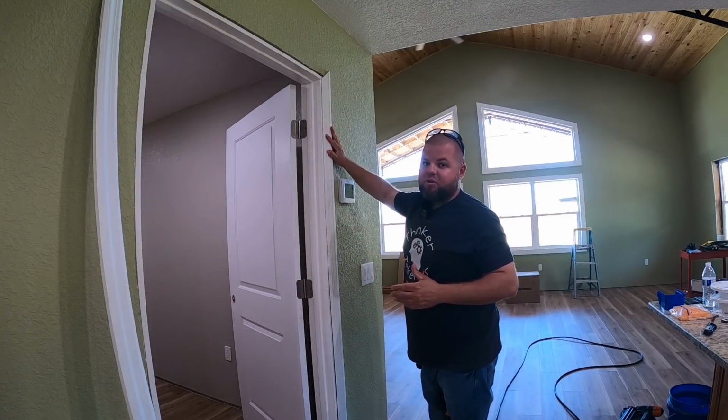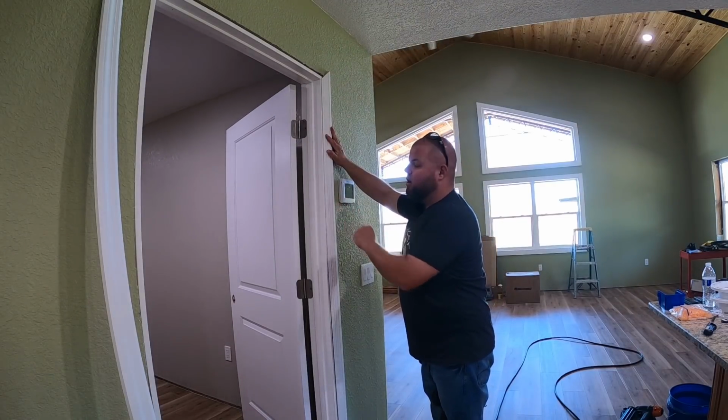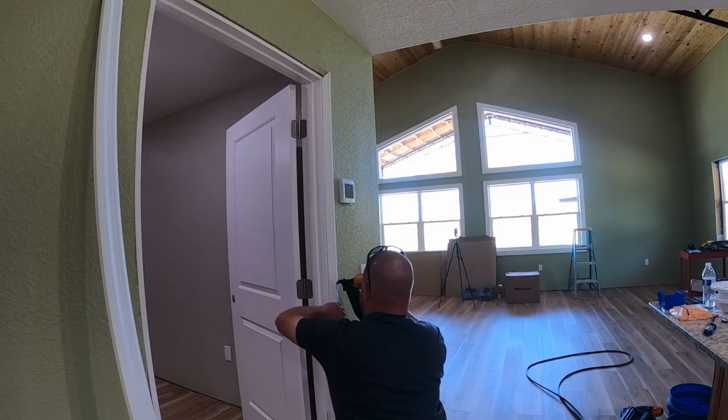Now, as far as this very thin edge, where I shoot it right into the door, I like to close that gap up some. I have a smaller 18 gauge nailer with 1¼ or 1 inch brads. You could use either one you want and makes a much smaller hole. I'll come back there and shoot a few in as well. So yes, this is requiring some patching.